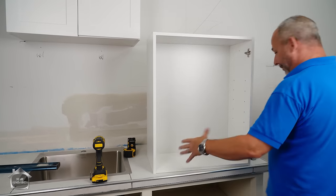The third patch, probably never seen before. This is my favorite patch. You take a piece of drywall tape and you put it where you're going to patch a hole. I've never shown this trick on my video before. Now, you take your drywall tape that you're going to use to patch the hole, and you simply cut the wall around the tape. And you can leave a little bit of extra space if you like. The idea is you peel the paper off, and then when you set this in, now it's the same surface, so you don't create a hump.